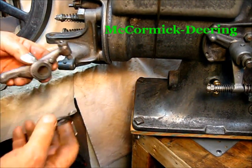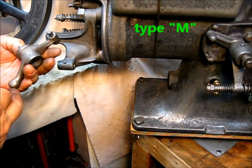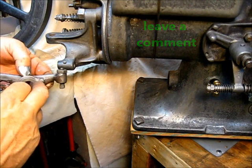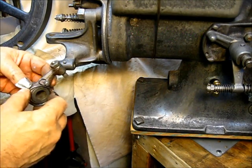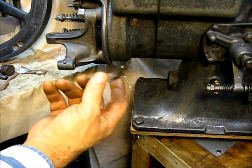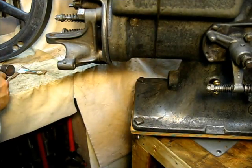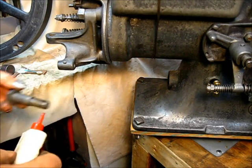If you're on Harry's Old Engine site and you've got a question, leave it here on this YouTube page as a comment or even a private message and I'll try to do a visual on it. This was a used one, but in order to get it to fit a little better, I took a round file and made a little gap on the side and clearance on the inside — it had some casting flash still in there. These springs are available and it's just cheap to put a new spring on there.